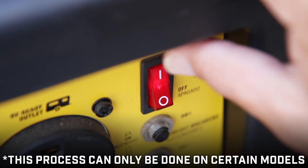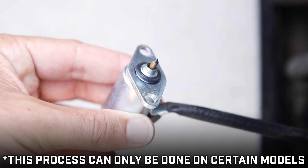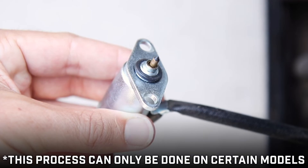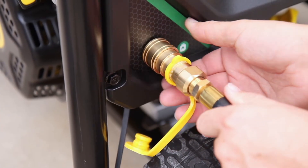Next, make sure the battery switch is on. Quickly toggle your fuel selector switch on and off. If your solenoid is in good shape, you'll see the shutoff pin move up and down as you switch fuels. Or simply reassemble your unit and run it on each fuel.